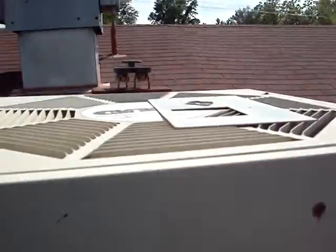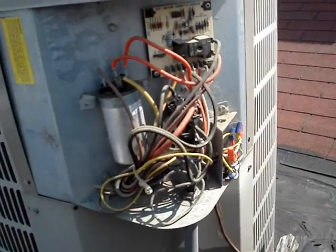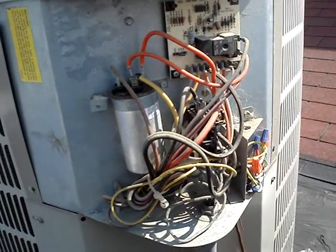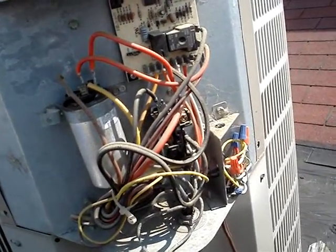Here's the Ruud — nice old unit. They just happened to leave it up here, and why not? Since the disconnect's right there, the old disconnect's on the unit, so I might as well leave the unit up here just to hold that disconnect up. The compressor and fan work, but they aren't coming on, which means low freon. So we're going to hook up to gauges.